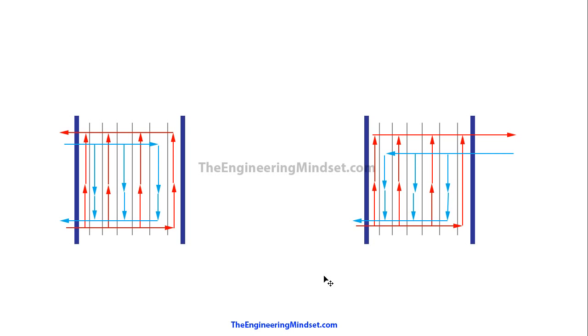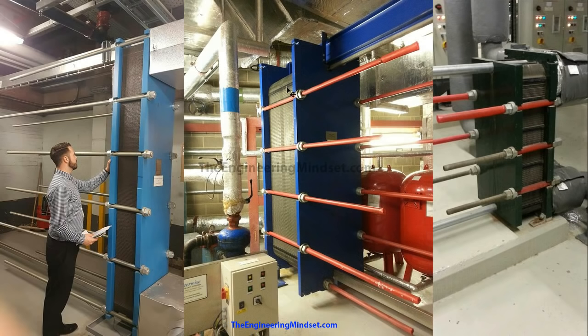There are a couple of ways the plate heat exchanger can be piped up. The most common version is where the inlets and outlets are all on the front plate — the fluids enter, flow through their channels, and make their way back to the front plate. The other version is where one fluid enters through the front plate and exits through the back plate. The first version is more common because you don't need to alter the pipework if you need to extend the heat exchanger in future — with the second version, all the connected pipework would have to be removed and remade.